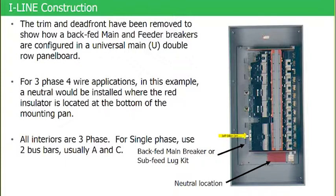Power enters in this area here, continues through the main breaker, is then distributed through the bus stack, and also distributed through all of the respective branch breakers — on either side. Power is then being distributed to all of their respective loads.